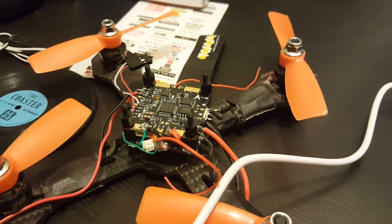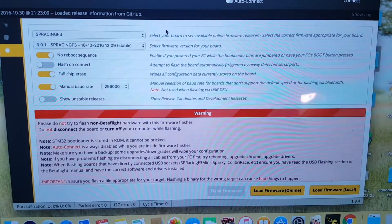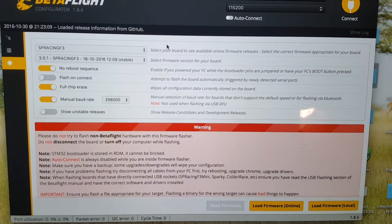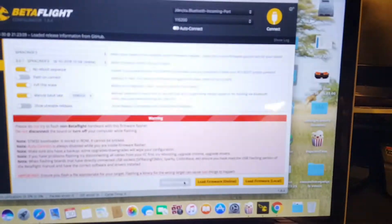Because this is a tight build, I recommend that before you close everything up, you flash the firmware to the latest Betaflight version. What you need to do is press the boot button while connecting the USB port, then load the firmware and flash it. I'll try to show you how it's done.